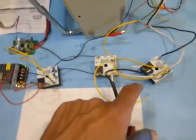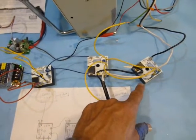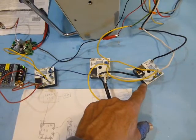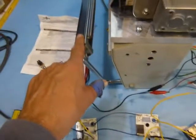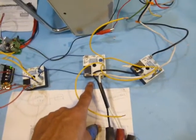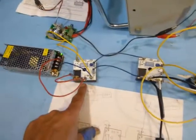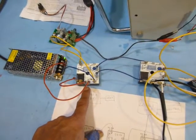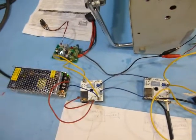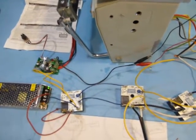The set of relays is here. These are all Macromatic relays. The first relay operates the heat seal unit, the bar. The second one is a delay which then activates the third one, which tells the motor to proceed after the bar has finished its business.